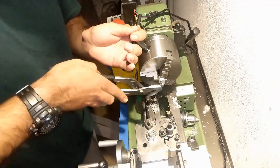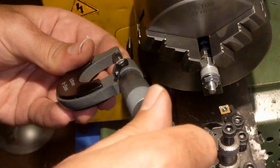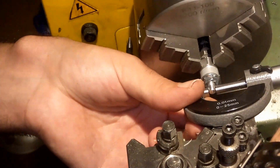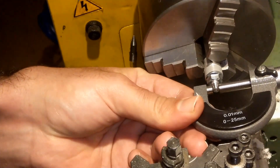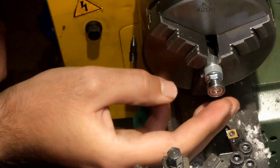The brushless motor already has two bearings on it. Because the belt is pulling from one side and most of the load is at the end of the shaft, it was wise to add a bearing at the end of the shaft. That was an important thing to do for the motor end.